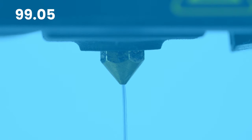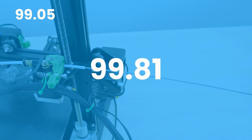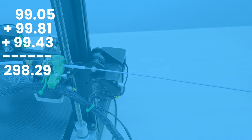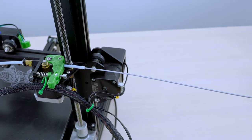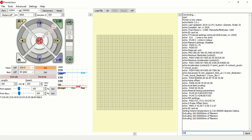We will not change anything yet. Instead, perform the measurement with the same data again. Recalculate the resulting length according to the formula and add the new number of steps to the previous result. Just to be sure, perform one more measurement. Again recalculate and add the new number of steps to the previous result. Divide the result by three to get an average of three measurements. Congratulations — you have just calculated a new number of steps for your extruder. We set up the new steps using the command M92 E followed by our new number of steps. Write this into the command line of the program and press send. This tells your printer to use this number of extruder steps until the next restart.